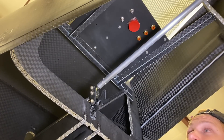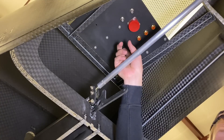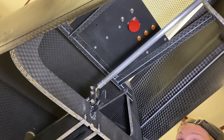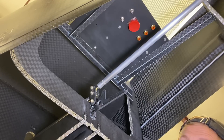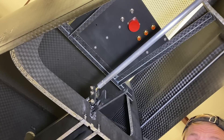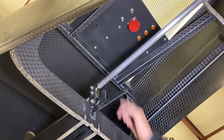Another example of electrically isolating material can be seen in our aft electronics plate. We basically painted the outside of the carbon fiber, which creates a non-conductive barrier between any metal and the plate itself. One key thing to note: if you're going to use paint to electrically isolate the structure, you want to paint the cathode — the carbon fiber — because if you painted the aluminum and got a small scratch in that paint coat, that could be an area of accelerated corrosion. Always paint your carbon fiber.